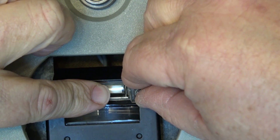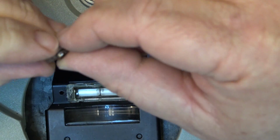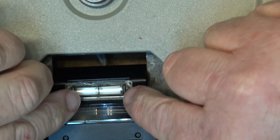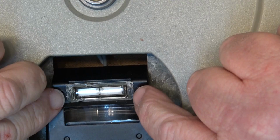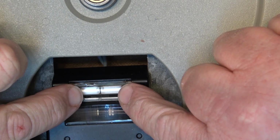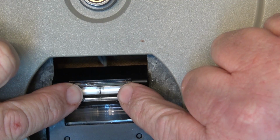And that's been broken on this turntable. So I'm going to try and make something that will hold this lamp in place, because it's got to be held down like that. And these terminals here are going to be live, right? These metal terminals, they're actually going to be live, so you want to have them insulated. Otherwise, someone that sticks their fingers in there could get a jolt.